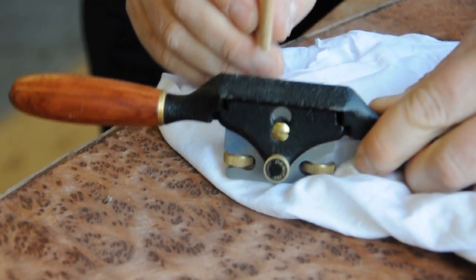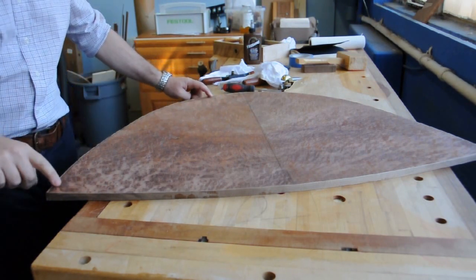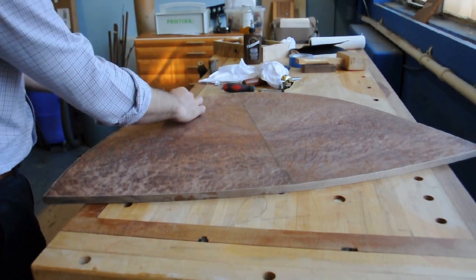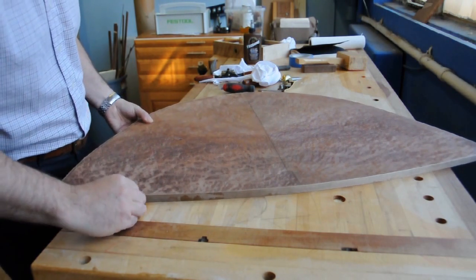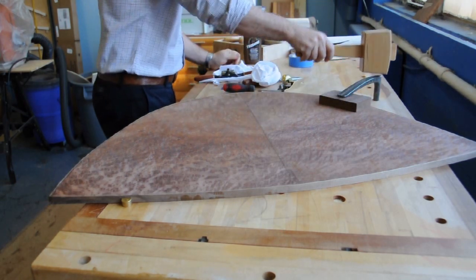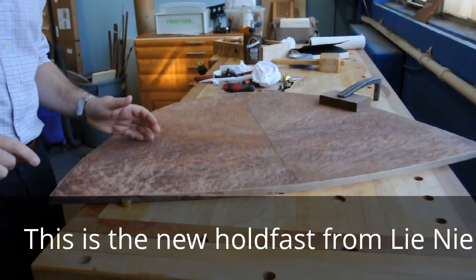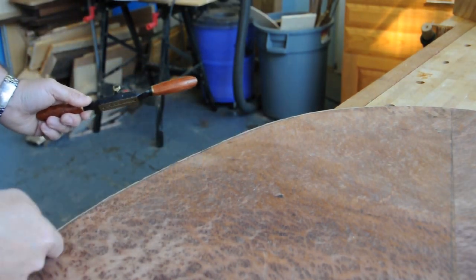So that's how I want this set. In this particular case I'm going to be working this edge from about here to here. I like to have this off the workbench so it's not interfering with my hand if I want to go down the edge. And I found the best way to secure this is to put a dog here, and then to use a holdfast over here into the bow. And that's pretty good - it's going to stop it moving. So here we go. I've got about three millimeters, maybe an eighth of an inch, to remove across the length here. So pretty aggressive.